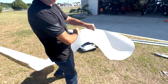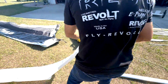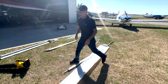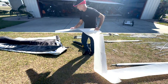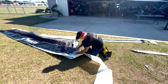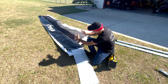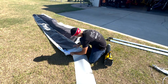You can see this is an older mylar — normally it's flat, but it wants to curve because it's been in the wing for about 15 years. So with that said, we're going to roll it over this way, make sure we get it in the correct orientation, and start feeding it in. Because the leading edge tapers and it's so much smaller at the tip, it's real easy — it just wants to go in, no problem at all.